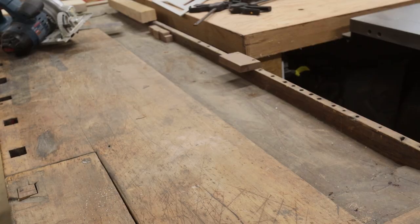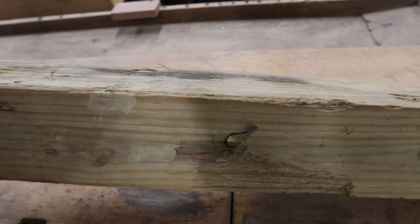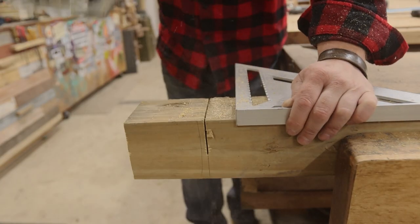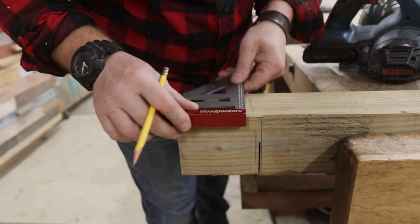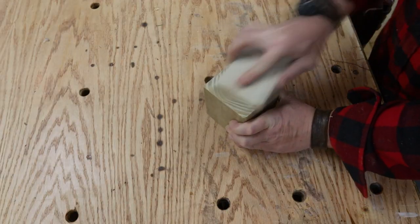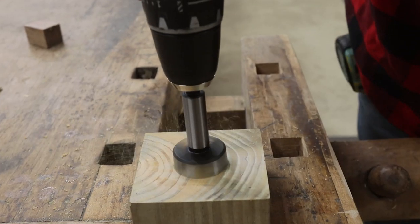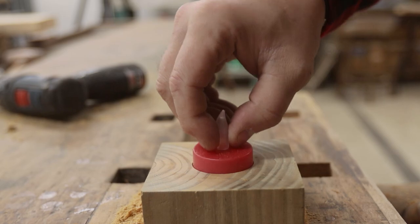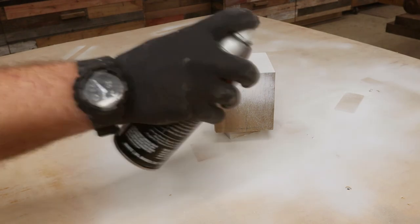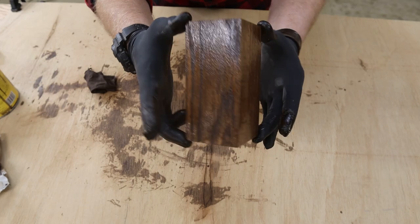Number five. For this project we're going to be making some candle holders. I grabbed an old 4x4 that's definitely seen better days — it really doesn't matter what it looks like because only the top side is going to show. After ripping it down with my circular saw and giving it a quick sanding, I grabbed an inch-and-a-half Forstner bit and drilled a hole deep enough so the LED candle fits flush. Then I put some paint and primer on it, and for variety I had a couple of pieces of oak that I stained for a little more contrast.